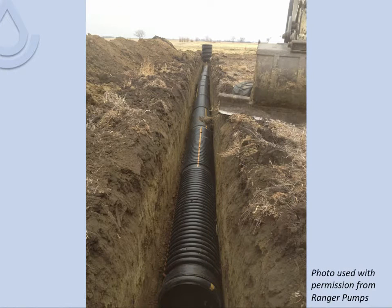Here again is a concrete casing pump with 70 feet of two-foot diameter dual-wall pipe to service about 160 acres of drainage through this pump. Most of our installers use this horizontal storage approach now and do not use large vertical storage sumps.